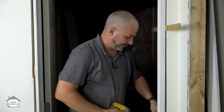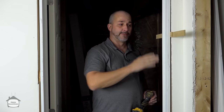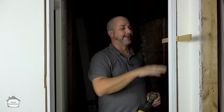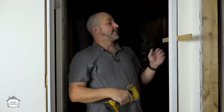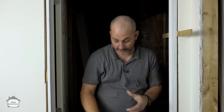Okay. Here we are. The reason I'm putting the screws in behind the doorstop is because visually, when the door's closed, you can't see the repair. This is nice and clean and open, nothing on the surface, paints really well, and this is like an MDF with a primer on it. So that's where I like to hide them back there. If you like and you have the opportunity, take the stops off, that's great too. It's just a whole lot of extra work.